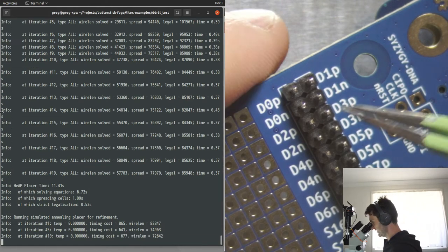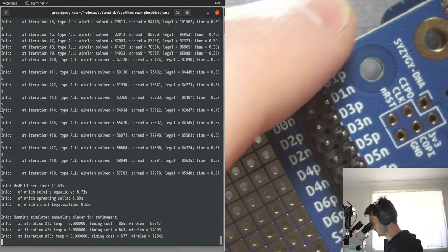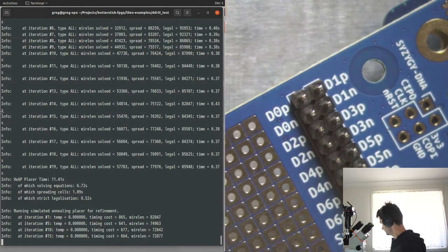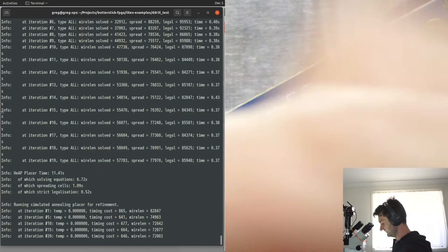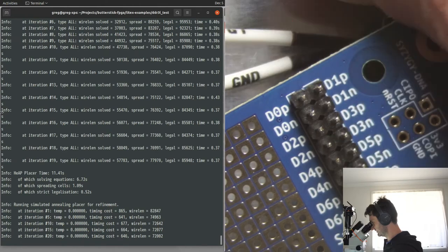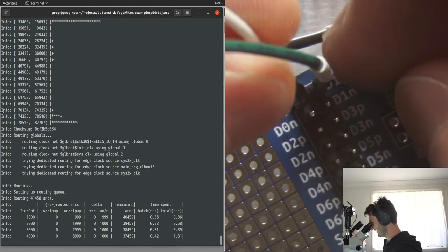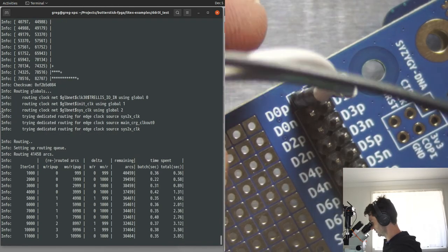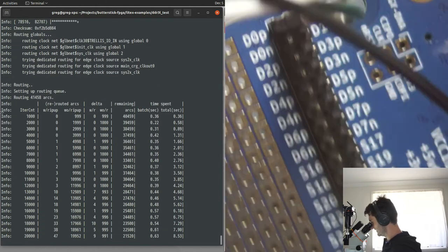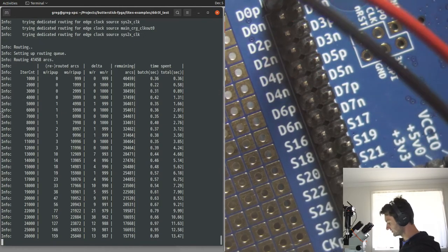So we just need to connect our TiGuard board up to 0 and 1, D0P, D1P. So we've got that here. We'll just use the handy breakout cable. So we're swapping transmit and receive. I think that's how these are wired, but we might have to play the old UART guessing game. You know, is my transmit and receive swapped or not?